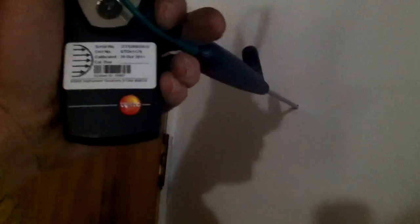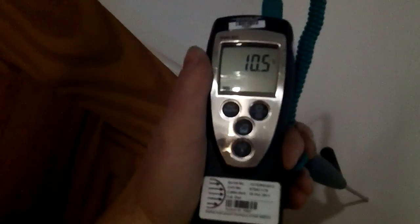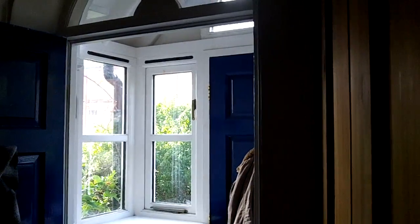I'm going to take some temperature readings using a thermocouple. You can see it's ten and a half degrees at the top of the house — notice that's actually inside the porch, so it's not an external wall. If we go down to the bottom of that same wall, it is colder — we're looking at about ten degrees at the base. If we then move across to the far corner...